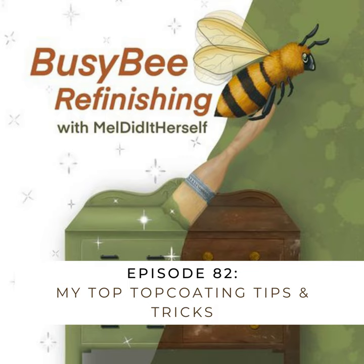When product pools in little details, the polyurethane dries almost to a yellow tone — even though it's clear on the rest of the piece — and it can look dirty on lighter colors. I use the Dixie Belle bell brush most often for both painting and top coating. I like the way it feels in my hand, the bristles are compact and tapered, and I don't put too much product onto it.